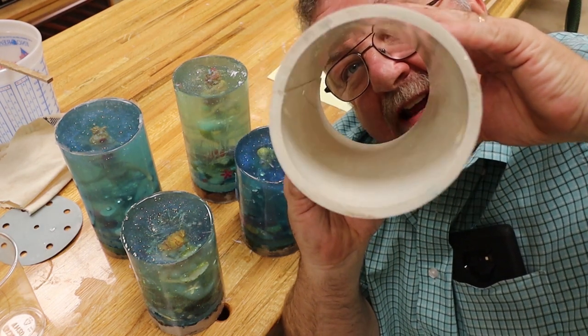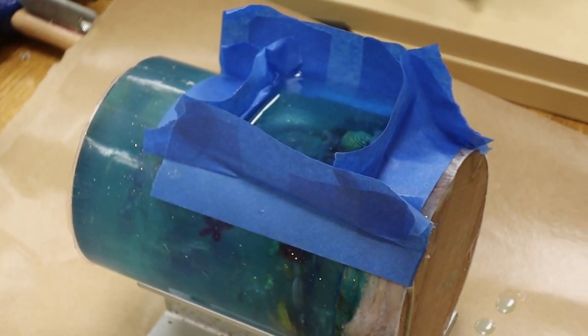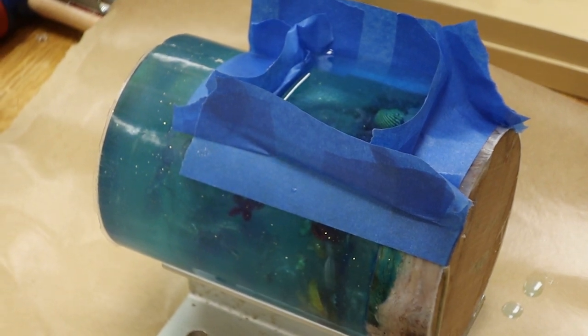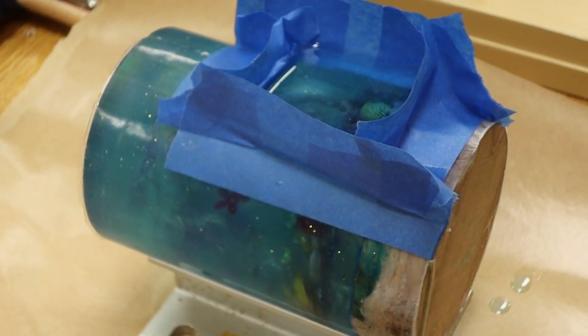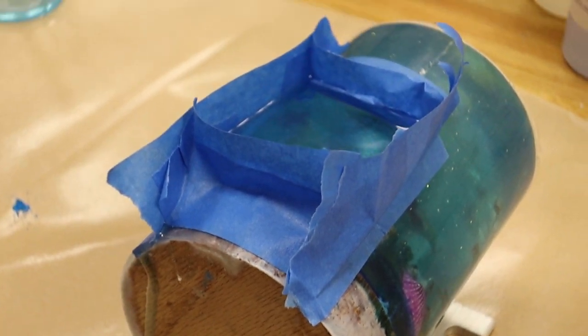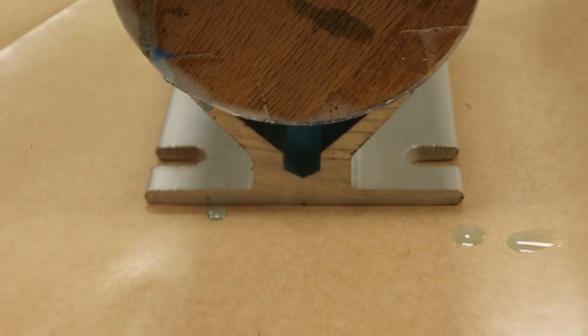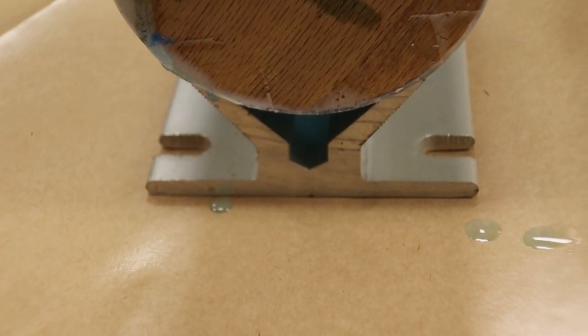Okay, guys, we got them out of the mold, all demolded. Sitting here on the counter and looking pretty. One of them had a quarter inch notch out of the side of the epoxy where an air bubble got trapped. So I had to come back and build a coffer dam on top of it and pour a little more resin. And I used one of my drill press pipe drilling jigs to support it. It happens to the best of us. You gotta do repairs now and then.